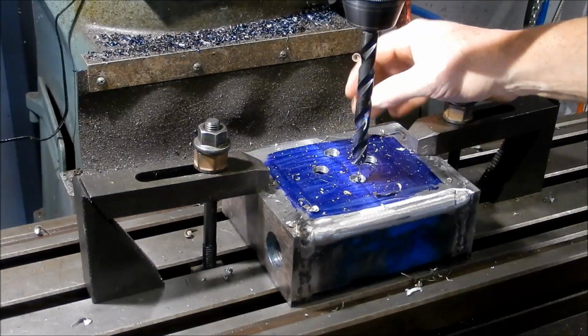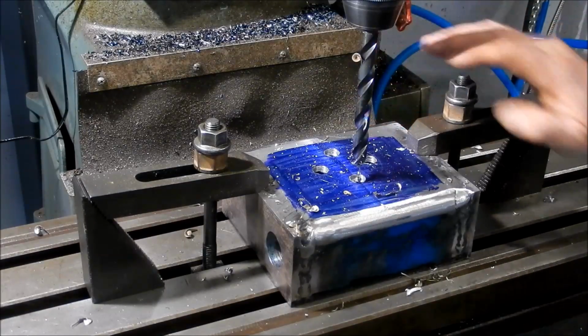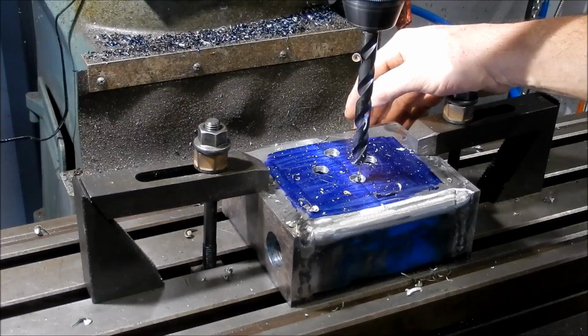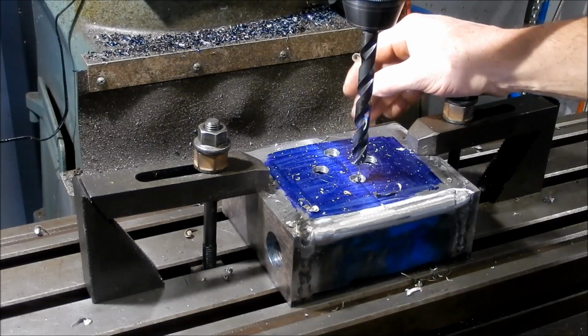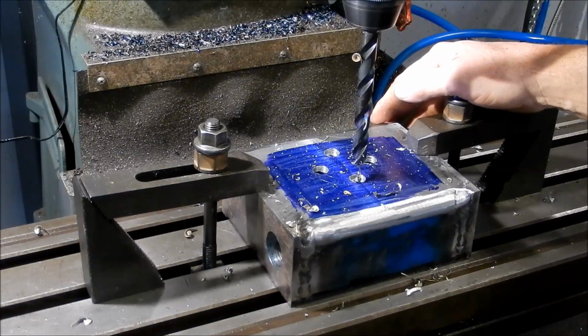Look, sometimes when you are doing design work and you've got a fabrication, sometimes it's a good idea to design in work holding methodologies, particularly on castings. If you can put a lug on one side or a datum or something that the fabricator has got something to work off to be able to hold that part down, that can be cut off afterwards. It has to be a non-critical component, but it just assists the fabricator with his setups anyway. Alright, I'll set up and I'll give that a lick back to size and get ready for that 25mm plate.